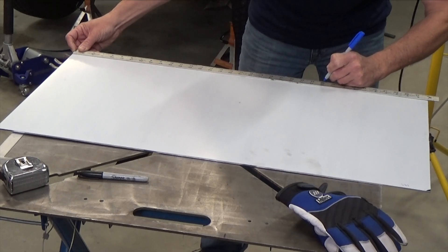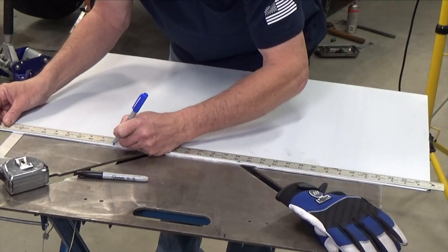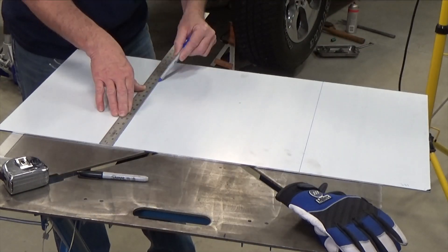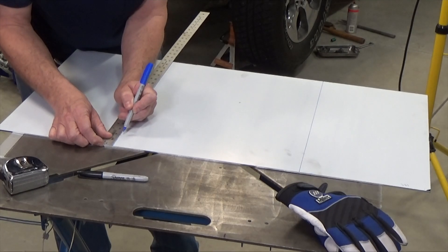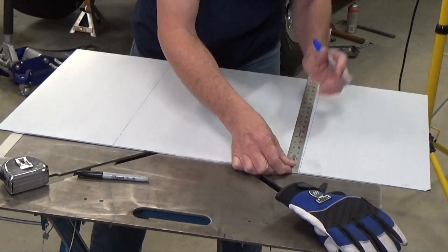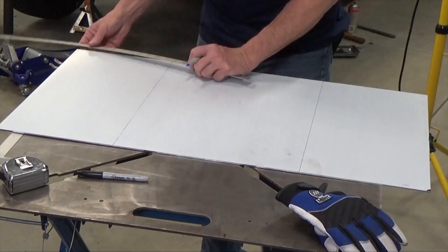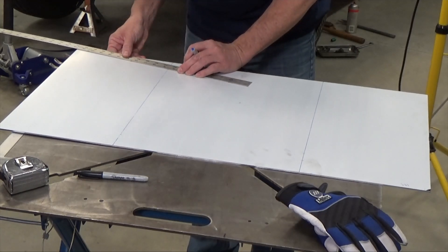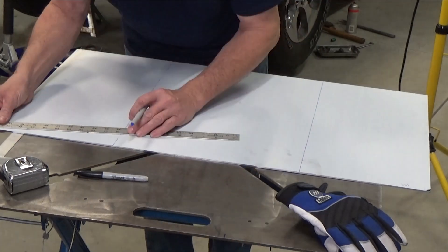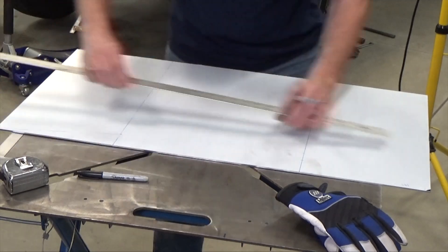On all your 35 inch pieces, mark 10 inches in from each end, and then mark two inches in from each side of the 10 inch line — this should give you 15 inches between them. Connect the marks on the 15 inch line to the outside edge of the 19 inch side. These are your cut lines and make up two sides and the top.